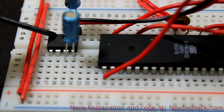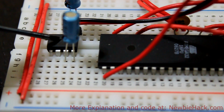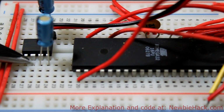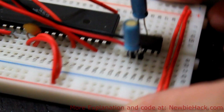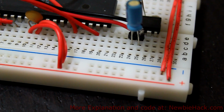So we're essentially turning on this regulator, and by putting set to ground, we're using the 5 volts that this is essentially designed for. Okay, now we're going to be connecting the set pin to ground. So we're using the default voltage output of 5 volts. Now we're going to connect the off pin to the plus side, so we're enabling this little IC. So we're enabling the regulator.